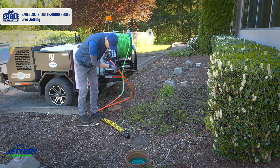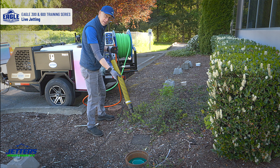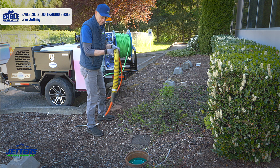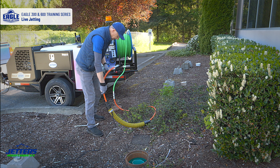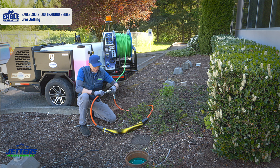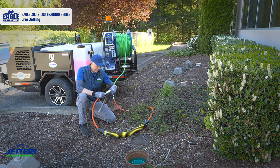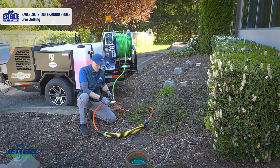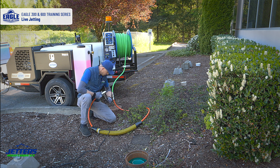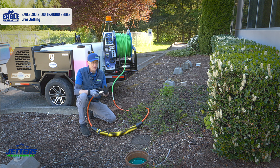We need to go through the tiger tail guide first. I've got a tether rope tied off here so that when I put the tiger tail in line it won't disappear on me. I'll go ahead and shove the hose through and then connect up my nozzle. I'm going to use a reaper nozzle in this situation. I do not recommend just hand-tightening your nozzles — they can disappear in the line, and premium nozzles are not cheap. If I was going a long way in, I would definitely double-wrench that.